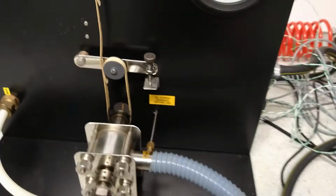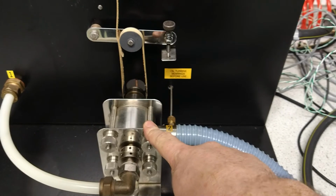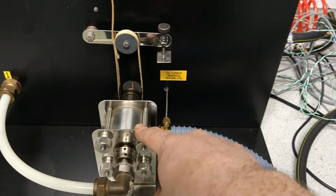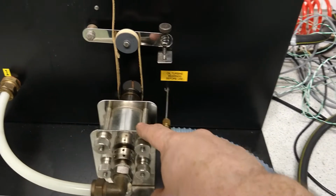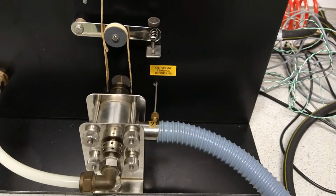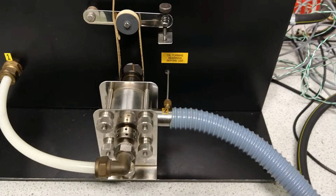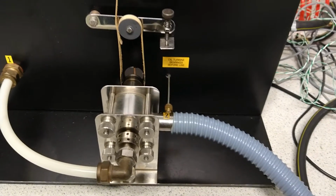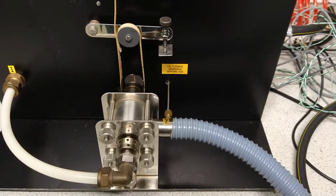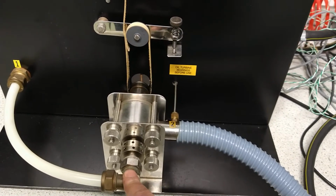Okay. Now the other thing you can work out is the power of the turbine itself. If you know the torque in newton meters and you know the angular velocity of the turbine in radians per second, so omega for the turbine, then the power of the turbine is torque multiplied by omega. So you can create a graph of the power output of the turbine versus omega, and that is not a linear distribution. It's a curve that has a particular maximum point. So there's a particular rotational speed of this turbine where its power output is a maximum.